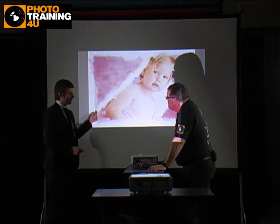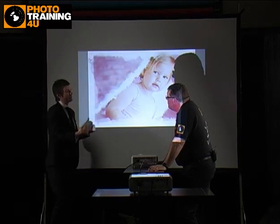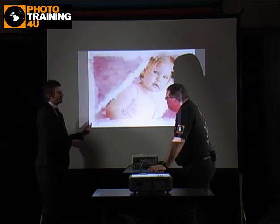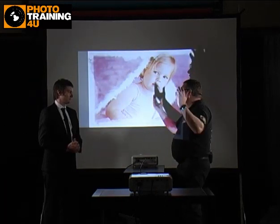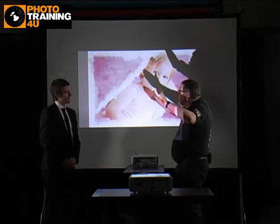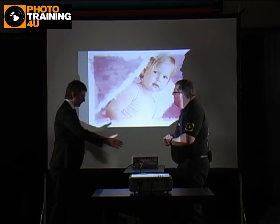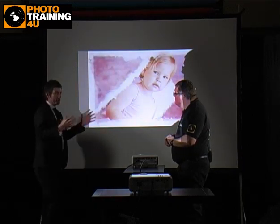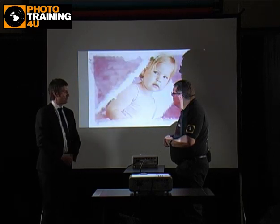On a rear projection screen, it allows the light to come onto the screen, but it stops the light going straight through. So if you've got space behind the screen rather than in front, you can actually project from the back, but then you need a rear projection screen. Traditionally in the big AV theatres, everything was back projected, because they could completely black-encase the background so they didn't get contamination coming through. Yeah, so essentially we would enclose the projector here and feed it through, so you could have a complete black area so that you're getting the maximum out of your projector.